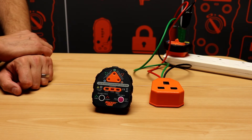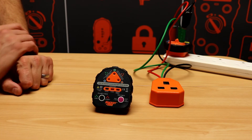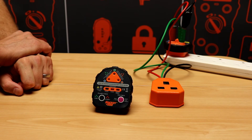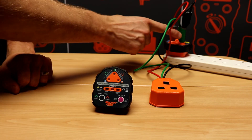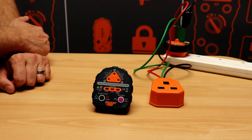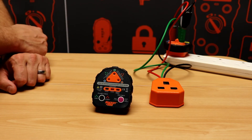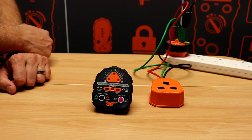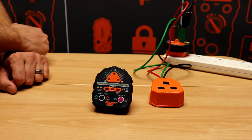In addition to the loop test, it will also do a polarity check and an RCD 30mA functional check. To demonstrate this polarity test, I have connected the neutral and earth and plugged them into live. I've then plugged the live into neutral. This will demonstrate how reverse meter tails on a TN-CS system will affect the socket tester's performance.